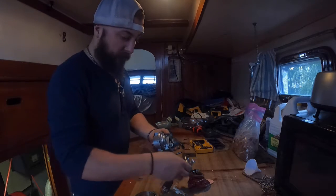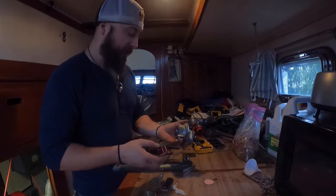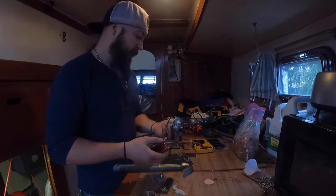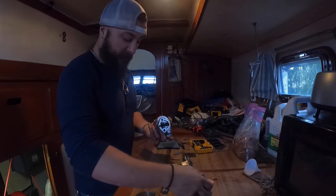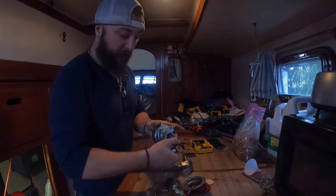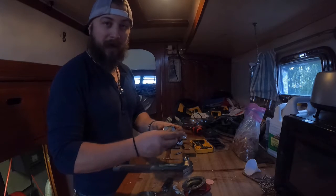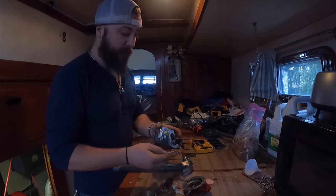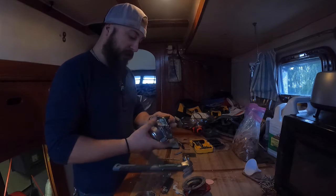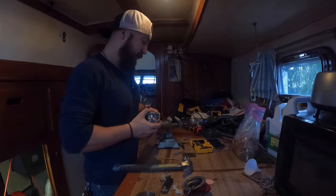So I just took the old body. Before I did that — I don't know if this will work for sure, but the base and everything looks the same. I'm guessing they made so many variations of these Lehmans that this might just be one variation. Anyways, it's just an arm that rides on the cam, and the cam lobe hits it and pumps it back and forth — that's what the sound is. When I tried to insert the original one, it was riding on the cam lobe for the delivery valves rather than the plungers, so it wouldn't even go in. I just bought this pump today for $120, hopefully it works.